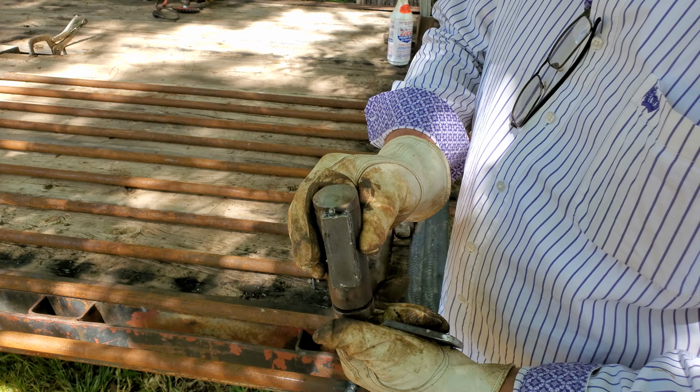We just cut it off, and then we make the hinge out of this, and then we take that little flat bar on there, and then that'll go down there on each end of this gate. Then it'll swing to where you can put your foot in there, but you can't climb the gate. And so then this will screw in all the way, and these things make real stout hinges, and you just crack that back 3 cracks, and there's your hinge.